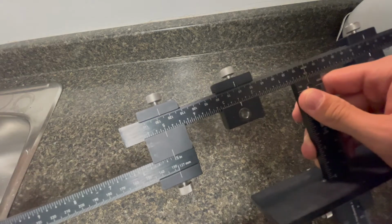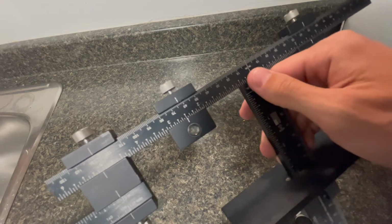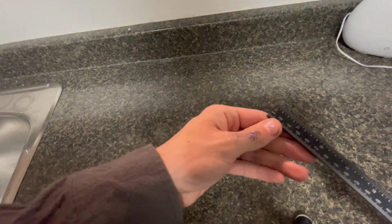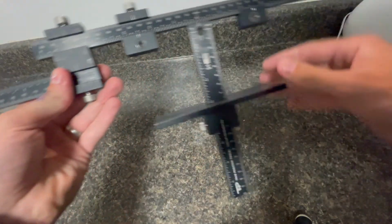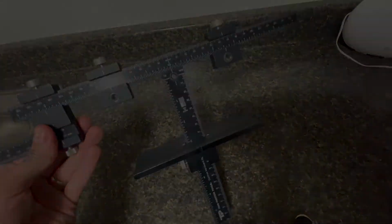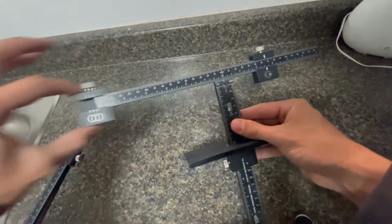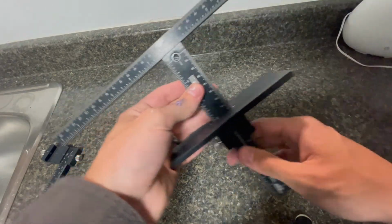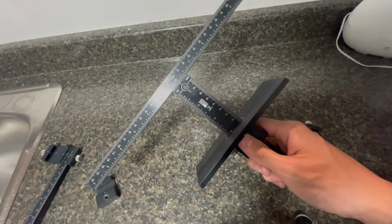It is important to line up both ends at the 5-inch mark accurately so that the ruler runs continuously from 0 in the center all the way to 22 inches at the end. The bottom stopper and the handle hole sliders are still used like normal. Another use for this jig is centering knobs. Since knobs only have one hole, we can remove these two pieces and use this single hole in the center of the jig. Set the stopper on the extension to half the width of the drawer face.